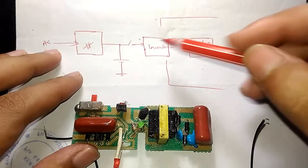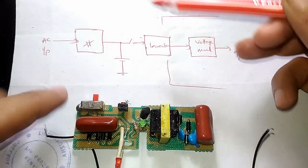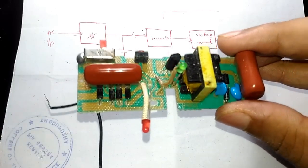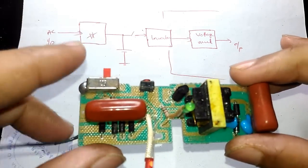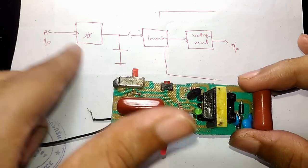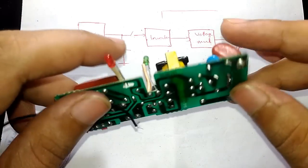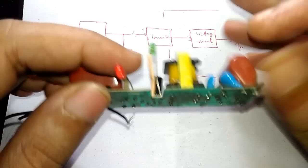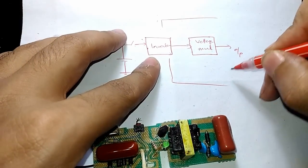This circuit has three components. The AC mains input is first introduced to a full bridge rectifier. The rectifier uses a capacitor dropper circuit to limit the current and reduce the voltage to a more manageable level — this is the most popular way of recharging mosquito bats, with no need for expensive transformers. Being a direct AC-related component, this is not isolated at all from the AC mains side — the entire section is actually very dangerous when in operation.